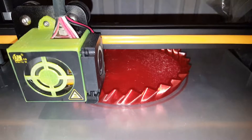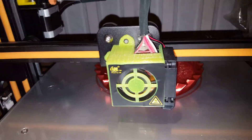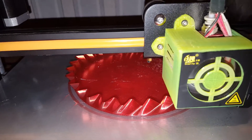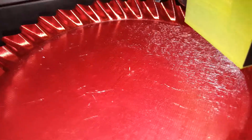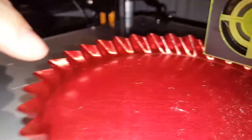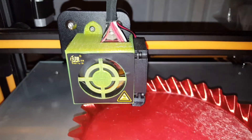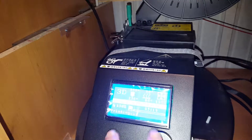Back at it with PETG. I've been trying a few things today, adjusting on the fly and I've made some good improvements as you can see halfway across this print. All that fluffy crap here I seem to have got rid of it finally when it comes around to this end, and it was simply because I needed to raise the Z height by 0.5.